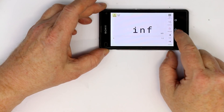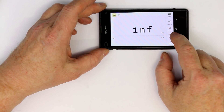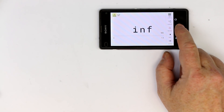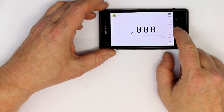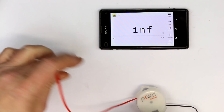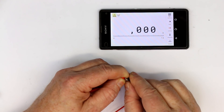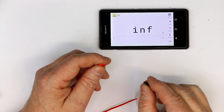There's a menu band on the right side. We'll cycle through and make a test measurement. We have resistance measurement, diode, and the specs: resistance goes from 1 ohm to 1 megohm. The diode test voltage is up to 0.5 volts. The continuity test beeps below 5 ohms — not the traditional buzzer tone, but a nice feature.